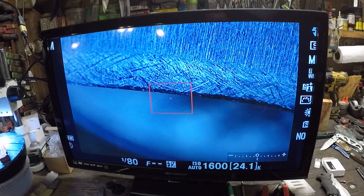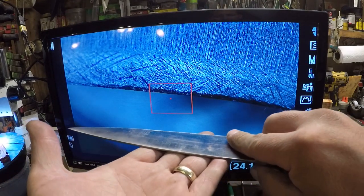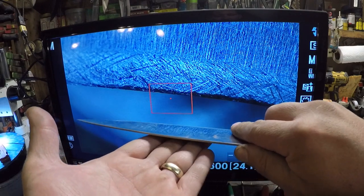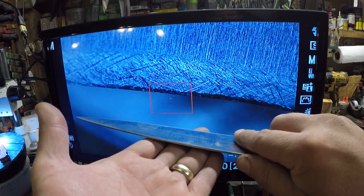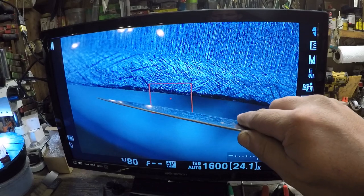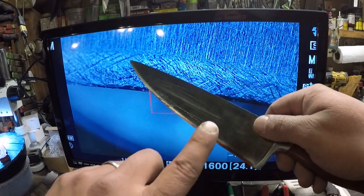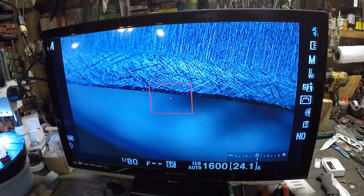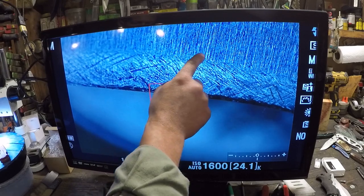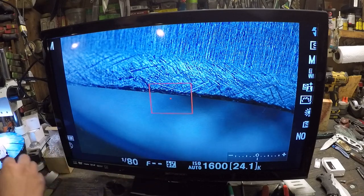Okay. Once the magic marker is on there, now you go ahead, lay the blade flat on the stone, raise it up until you feel your edge bevel, and then you start sharpening, right? Okay. Well, if you're sharpening an awful lot and you still haven't pulled up a burr yet, if you've magic markered this, now what you can do, I remember what this looks like: blade bevels, edge bevels, and then this part right here that never got touched.